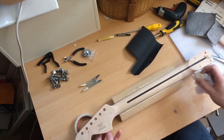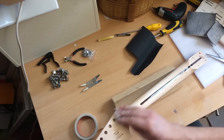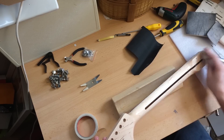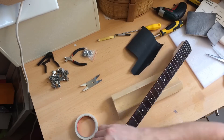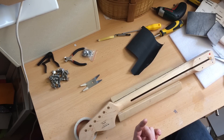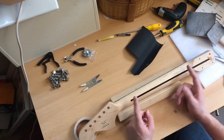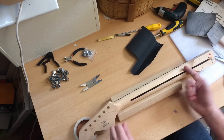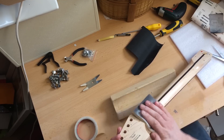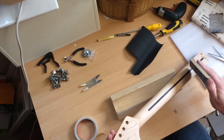What I'm doing now is a process my dad showed me when you're working on wood. It's called whiskering. You wet the wood like this — wetting the wood will cause any fine splinters, or whiskers as they're called, to stick up. Then by going back to the 400, those little whiskers will be whisked away.